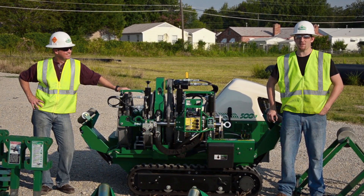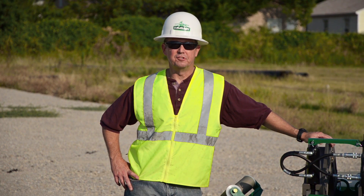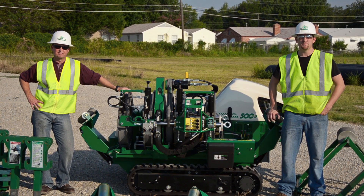Hi, I'm Chris Passmore, Senior Account Manager with McElroy Manufacturing. And I'm Vince King, Service Business Manager with McElroy Manufacturing. We're here to talk to you today about setting up a job site and we're going to incorporate some productivity tools that are really going to make your life easier. The way we set up our job site will vary depending on the needs of the particular job. In this case we need to fuse 200 feet of 12 inch IPS DR-17 for a temporary sewer bypass. We'll fuse it up and then move on to the location for install. Let's take a look at the equipment we have on hand to help us complete this task efficiently and productively.